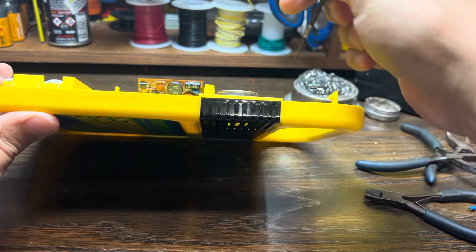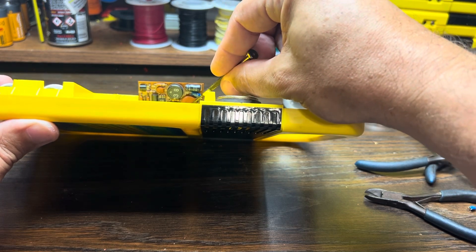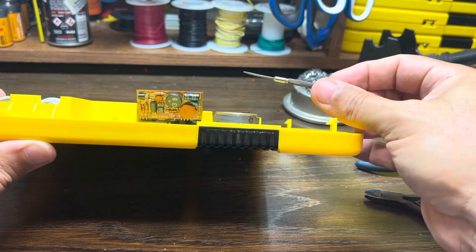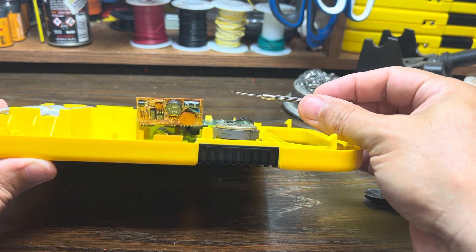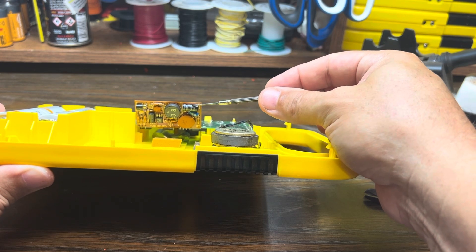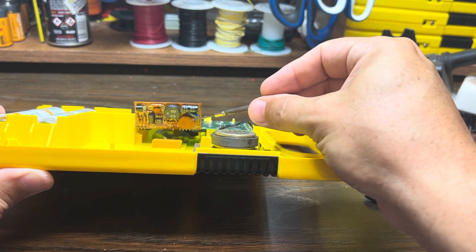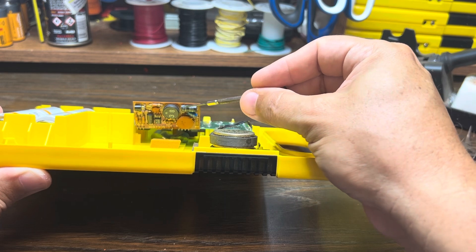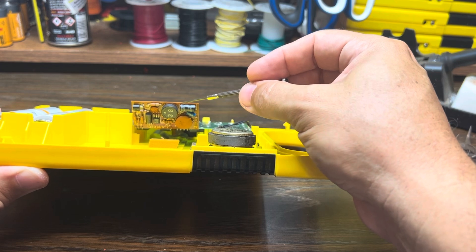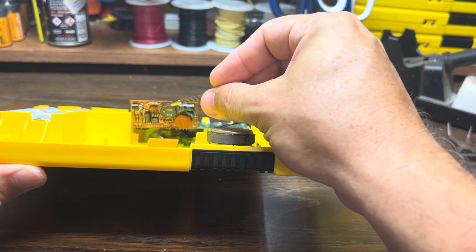This one's good. If it were still acting up, what I would next do is replace this little capacitor here and this one here, but I rarely have to do that — it's usually the blue tantalum one. I'm kind of surprised because I never thought capacitors like that would wear out. These electrolytics are pretty notorious for going bad too, and I've replaced a few as a last resort. So in order: the tantalum first, then the electrolytic, and then if really necessary the ceramic ones.